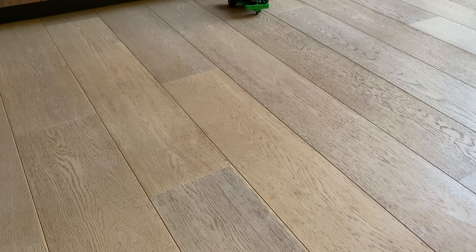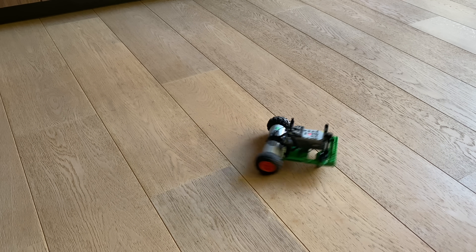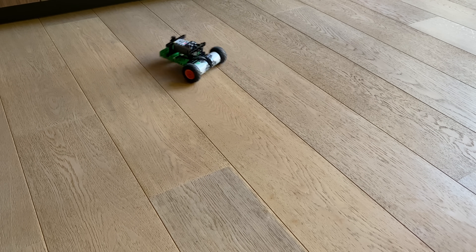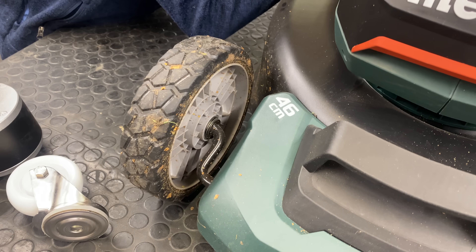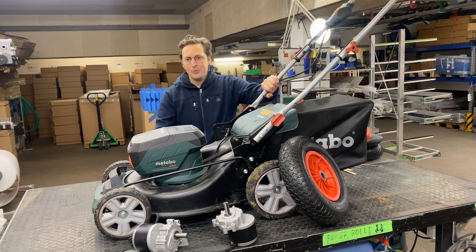With casters you're very maneuverable and you don't have any skidding anymore, and that is great for traction but also for maneuverability. So these are like a zero-turn mower and that's what I'm going with here. These things have to be absolutely parallel — if you tilt them they don't steer anymore. So that will be a challenge to get this to move in a parallel fashion with this kind of wheel.